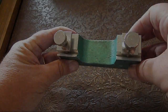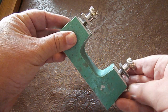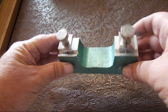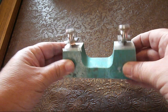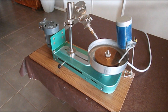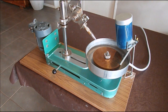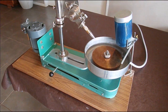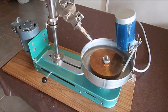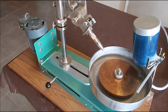A very important piece of kit for your faceting machine when you buy it is a transfer block or transfer jig. You will need this item and it will make life very difficult if you don't have it, so make sure your transfer jig comes with your machine. Last but not least, make sure that you have a drip tube for your faceting machine. There is a tube running from the back of the machine down the back of the table that will release all the water and debris from the pan while gem cutting. Make sure that tube is quite wide — you don't want a six or seven millimeter tube or it will get blocked up with debris.